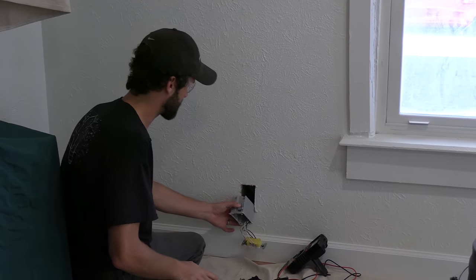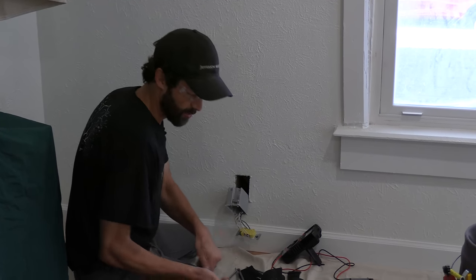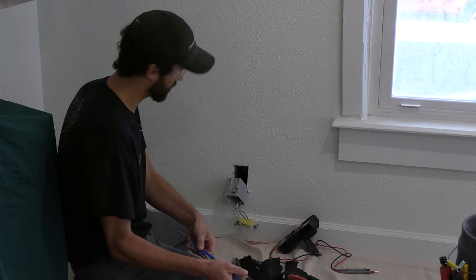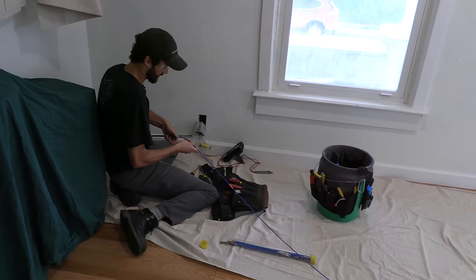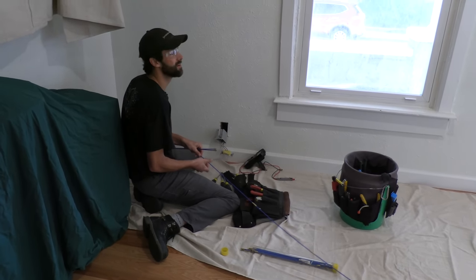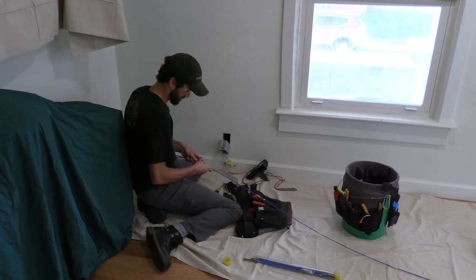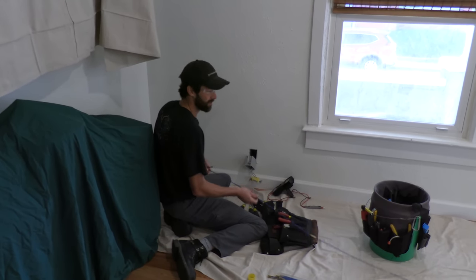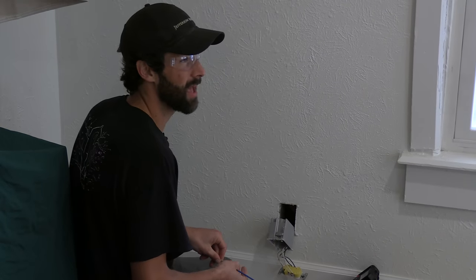It's nice we've got a remodel box — we can pop this out and send some fish sticks up the wall. I've got highly flexible fish sticks, which is nice from the standpoint they'll make that turn and head up the wall, but they're not going to push as hard or as far through the insulation, and we do have insulation. If we had a light kit on the fan — let's say three LED light bulbs — it's just another fraction of an amp. Even back in the old incandescent day with yesterday's technology, you'd be at an amp and a half max.